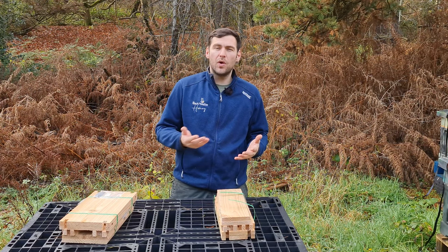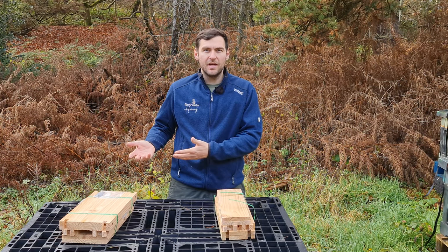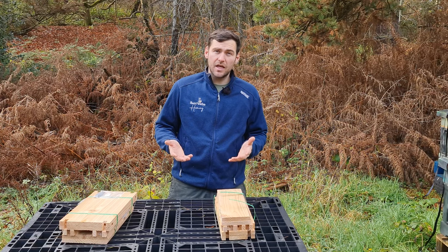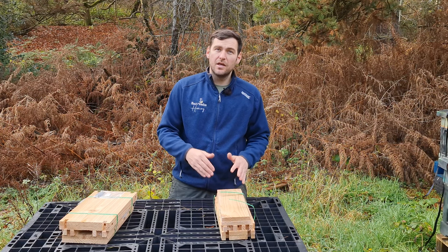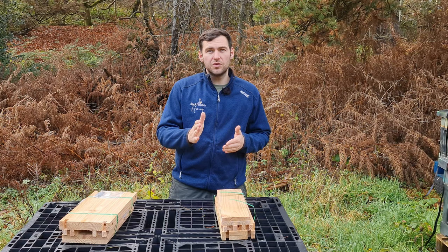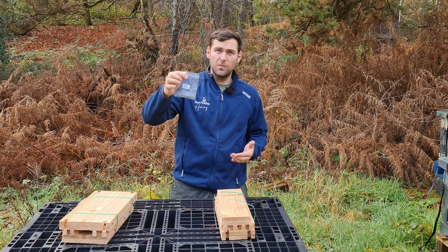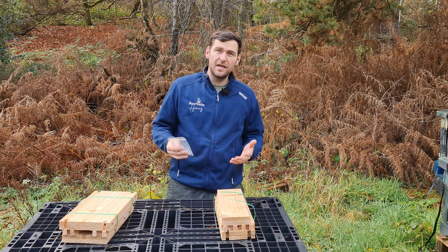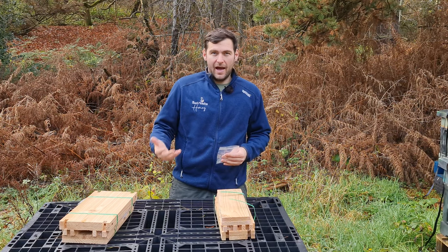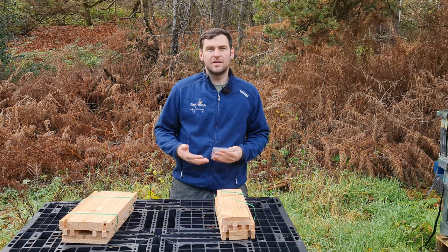There are a few different methods for putting together a wooden kit. You can just glue it and clamp it, you can nail it, glue it and clamp it if you need to, or you can glue it and screw it. I think gluing and screwing is the superior method but it takes quite a lot of time because the wood is prone to splitting. So I've moved back to just using the nails that come with the item, gluing with exterior grade wood glue, and then clamping as well — it's the quickest method and gives really strong results.